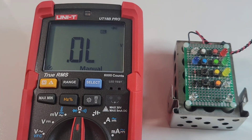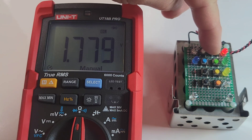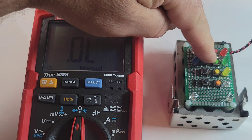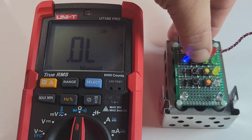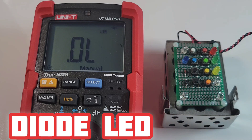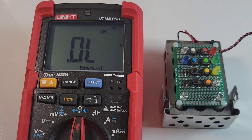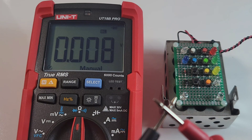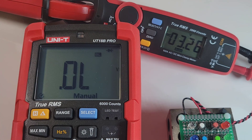Time to take a look at the LED and diode test. Starting off with the red LED — it is lit with a forward voltage drop. Onto the green — same thing, good stuff. Over to the yellow — nothing, nada. Over to the white — yes, lit with a forward voltage drop. And the blue — no problem. So just that picky yellow was giving us a problem. Standard diode test — no worries. You do have that nice audible beep in diode mode, which is always a bonus. Open voltage in diode mode: a healthy 3.2 volts.